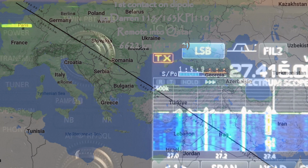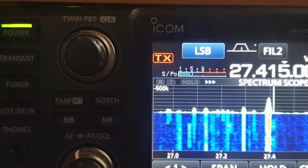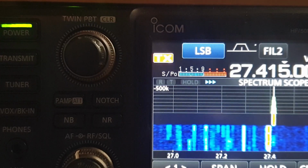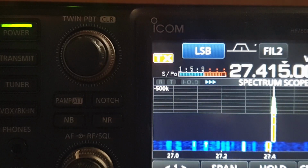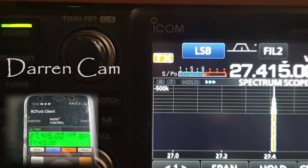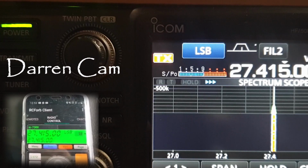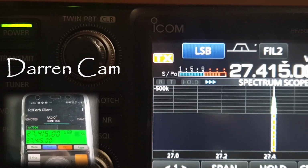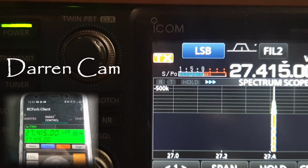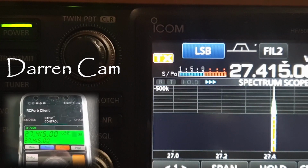You did come up 5 and 7, 5 and 8, but it's quite a lot of good. There's a bit of QRM on it. Roger, Darren. Well, I'm hearing you, no problem. I still have the same amount of QRM I always have. It's just under the 5. Normally I get a signal 5 of QRM, but that is on preamp 1. I always use the 700 on preamp 1. So if I drop the preamp down to zero, then I do have a low noise floor, but...